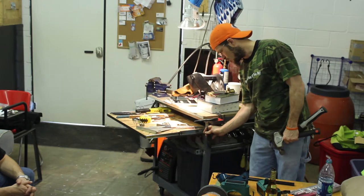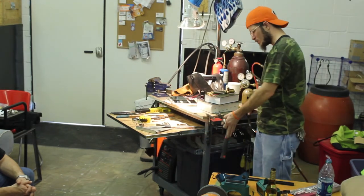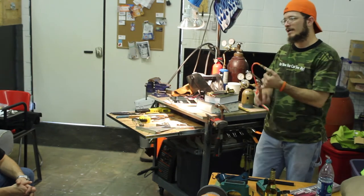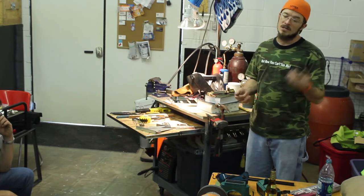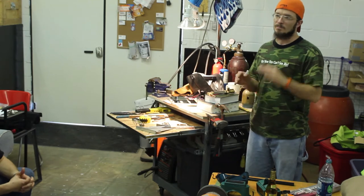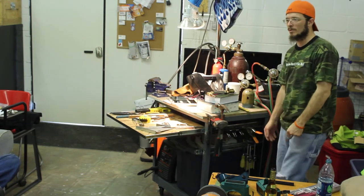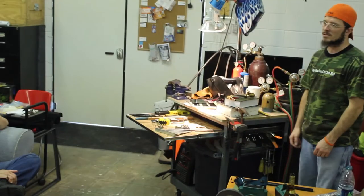Also, a lot of times you'll weld something, especially in the beginning, you won't get penetration, you won't get a very good weld at all. You'll literally be able to take the item out and drop it on the floor and it'll separate. Because it was dirty, you didn't get hot enough, you didn't get both sides hot, you melt one side, the other side kind of drops on. It is really no different than a cold solder joint on steroids. It's the exact same concept. If both sides don't get molten, you're just going to stick it to the other side and you can break it apart pretty easily. So that's a pretty important thing to know. And that's what you can use the hammers and things for, to whack them and see that it's still there.